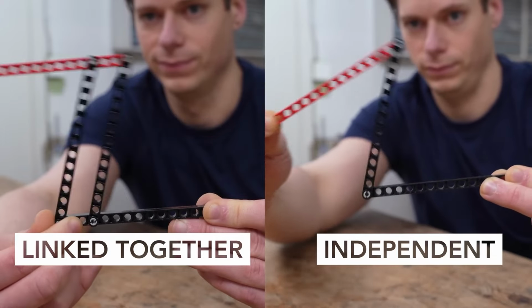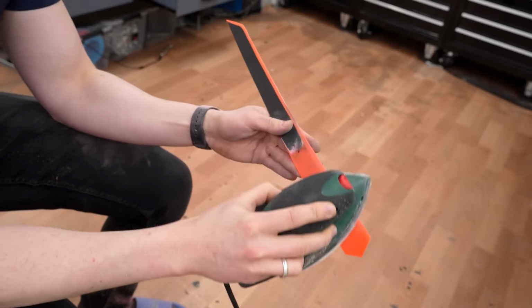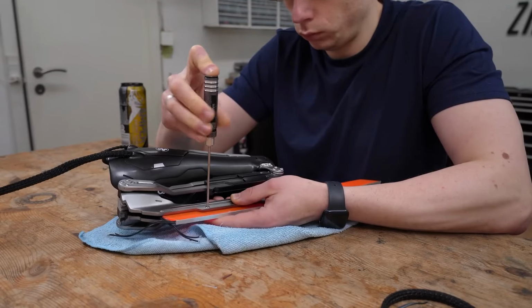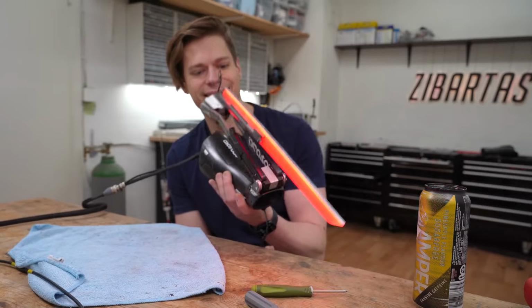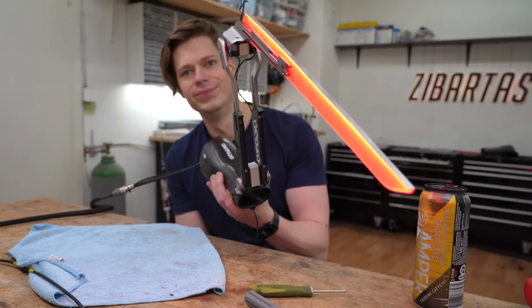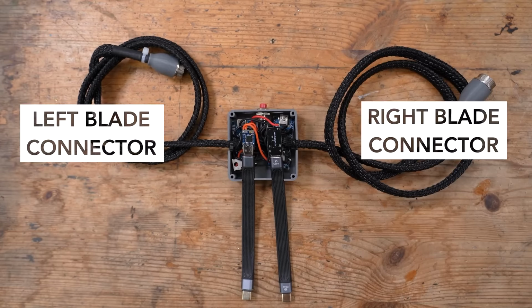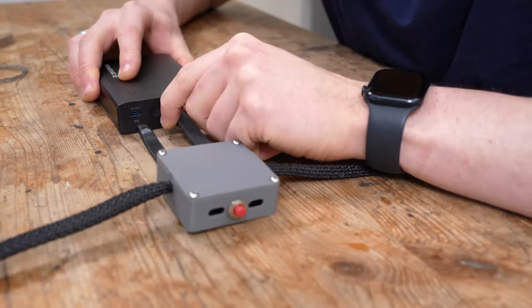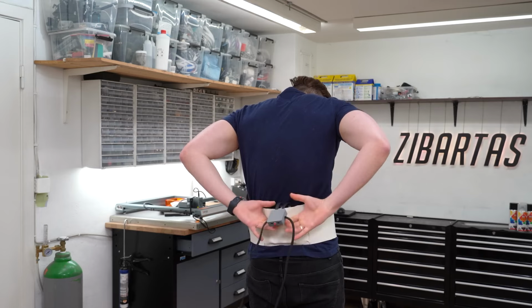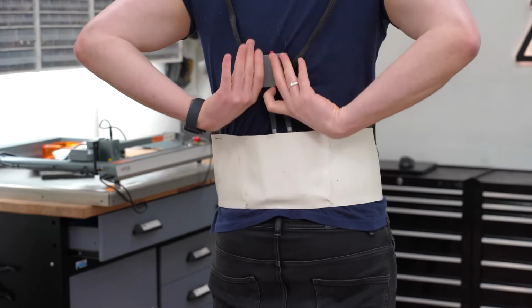The glowing blade is achieved using some edge-lit acrylic, but he's tapered it down by sanding, not just to make sure it glows fiercely, but also to reduce the weight, so the servos don't have to work as hard. The animation is controlled by pressure sensors in his hands. The servos are driven by an Arduino Nano, and everything is powered by a small portable battery held in a waist harness on his back, ideal for keeping all the non-visual elements out of sight.